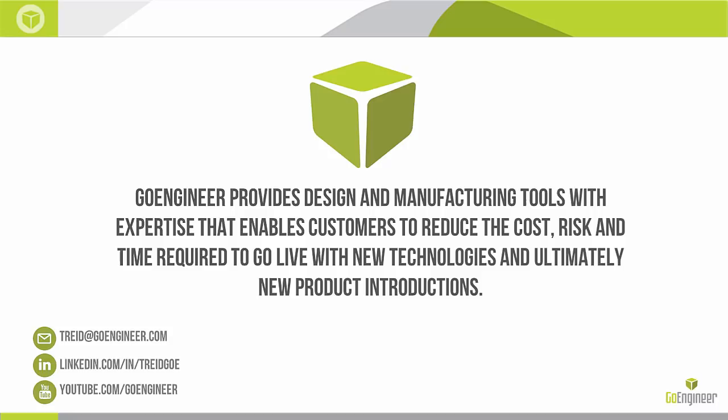And that about does it. This is a short and sweet 3D printing 101 topic covering support material: the importance of support material and what role it plays, how necessary it is to take full advantage of your printer's functionality, and the differences between FDM and PolyJet support materials. FDM primarily uses water-soluble hands-free removal, with breakaway support on higher-performance materials. On the PolyJet side we have either the water jet or soluble support. Stratasys has more complete information available on FDM support removal best practices — download it or email me at t-reed@goengineer.com. Thanks for joining, we'll catch you next month.